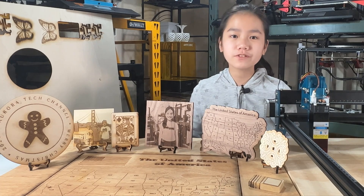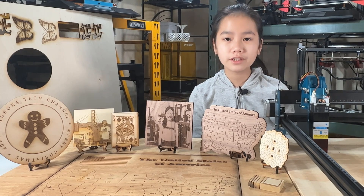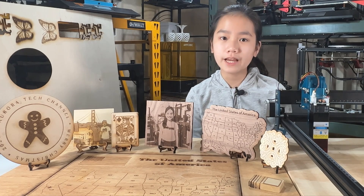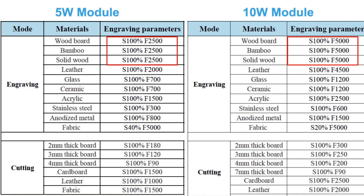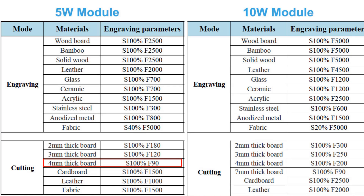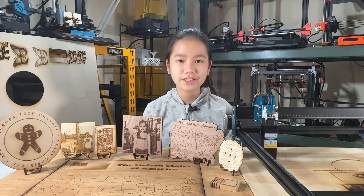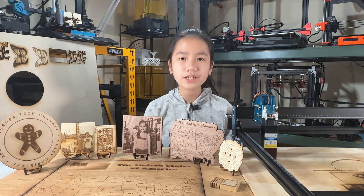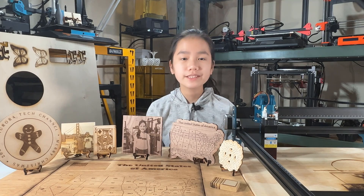Here are all the parts we made with this machine. We had a lot of fun playing with this laser engraver and trying different kinds of wood. The laser module we used is the 10W one. For engraving, both 5W and 10W can get the job done — the only difference is you can engrave two times faster with a 10W module. For cutting, the 5W can only cut up to 4mm of wood according to the manual, while the 10W can cut up to 8mm of solid wood based on our own test. If you're interested in this machine, the link is in the description. Please hit the like and subscribe button — my brother and I make a new video every weekend, so check out the channel on Mondays for something new.